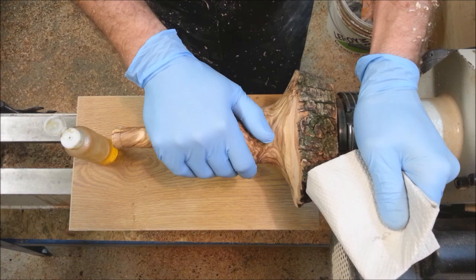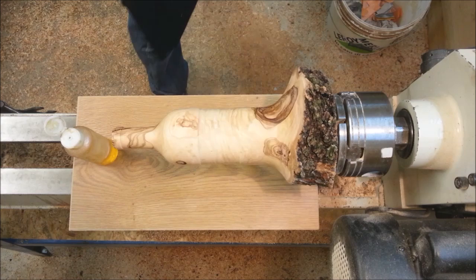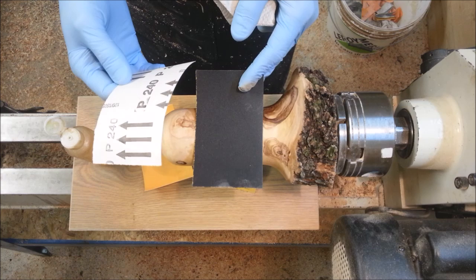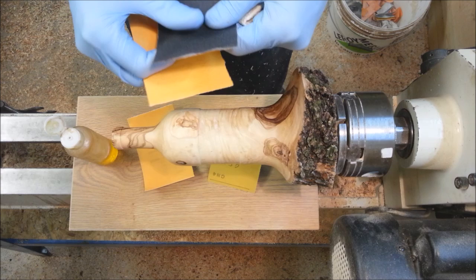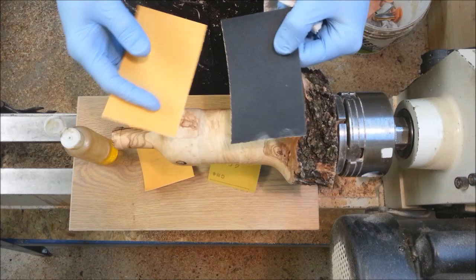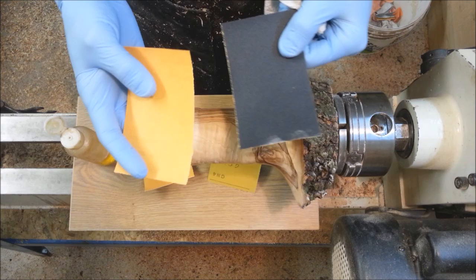A friend of mine from the US who works for 3M — Christopher — sent me a few packages of high quality sandpaper. Just as an example, this is the 3M sandpaper, 240 grit, and this is the cheapest sandpaper I could find in the area where I live, also 240. If you just touch the sandpaper, you can feel that this one is obviously much thicker — it's on a thicker backing paper. It's going to be more comfortable to work with. But when you actually sand with those two, you can see the difference — you can see the amount of material being sanded away from the wood with the cheap sandpaper.